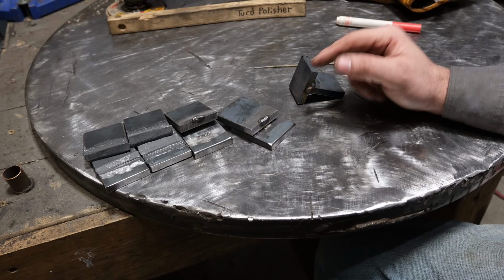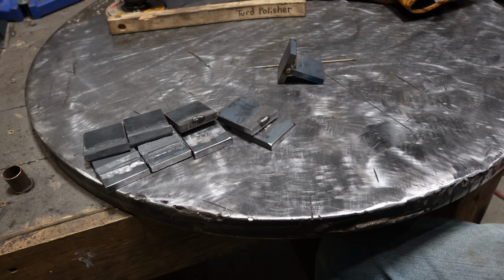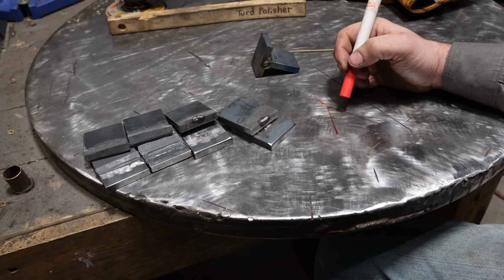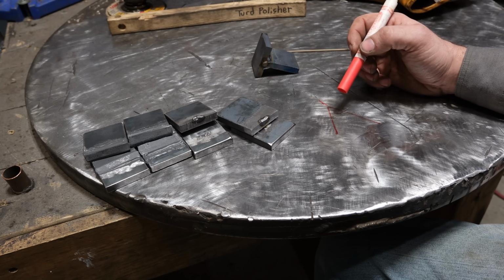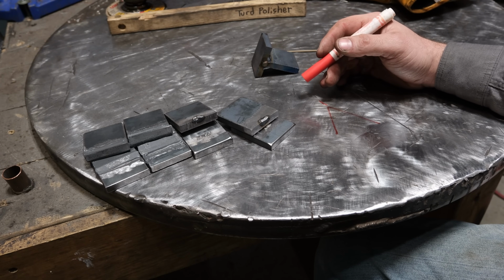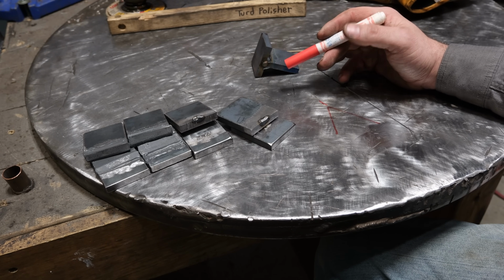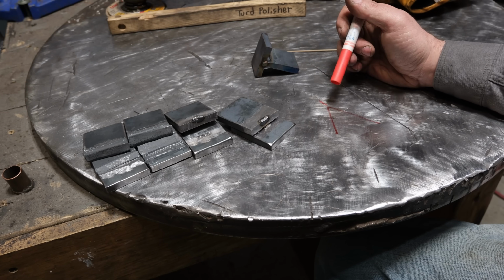So in the reality of what you saw here today, JB Weld, if it was actually holding something more like this, where it's equal on both sides and you put weight there, it wouldn't even handle probably 200 pounds before it failed. Most of what you saw was simply, like I said, pushing this plate into the table or into the shop press. So the ratings are far higher than any kind of practical rating you would find on this. So no, don't go repairing your jack stands or motor mounts with JB Weld, or for that sake, doing little 1/4-inch welds with no throat depth and think that you're okay.